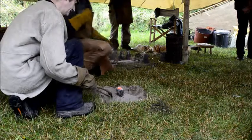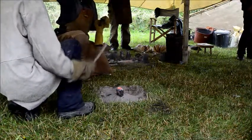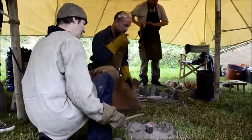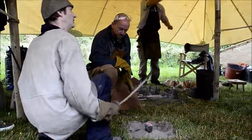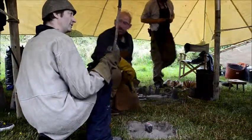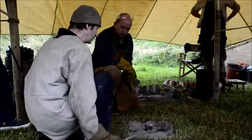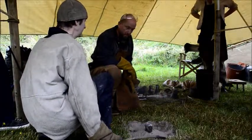When you're forging with iron you can work it when it's red hot and it's quite malleable. Bronze is the opposite — if you work it when it's red hot it just cracks and comes apart. You actually have to let it cool down. You can forge bronze cold — you hammer it until it gets really hard, but if you hammer it too much it'll start to crack. Then you bring it up to a red heat, which is called annealing — it softens it again.